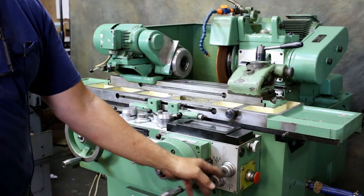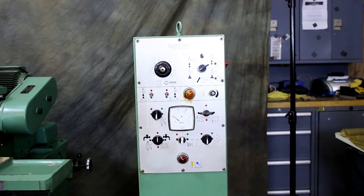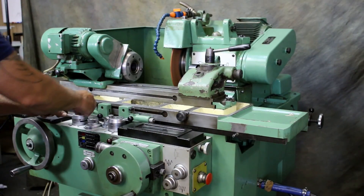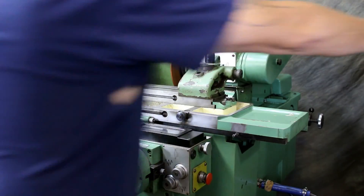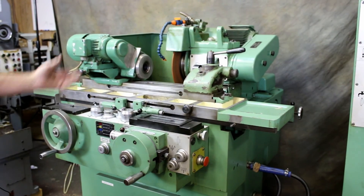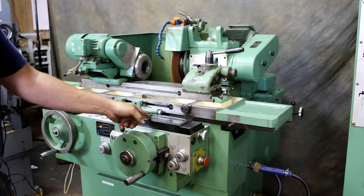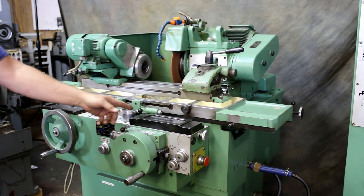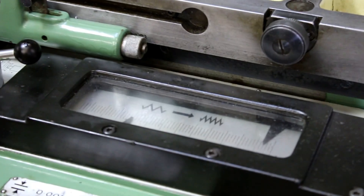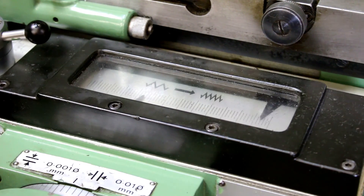We'll do another cycle. We're in the back now — when I switch the switch, our headstock comes on, our wheel head came in, and we're actually feeding in right here, not with our hand wheel. Our hand wheel is up against the dead stop; we're feeding in with the infeed mechanism of the machine. When it gets to that point, you have two different feed rates — coarse and fine. Now we've gotten to zero, you've got your light on, the timer is up, and the slide goes back — that's the automatic plunge grinding cycle. The other cycle would be to include the table and change this setting to one increment at each reversal. Our headstock came on, our wheel head came forward, and at each reversal we're moving forward with this little pointer — in the traverse grinding mode that needle moves forward. Obviously we're going much faster than you would normally grind.